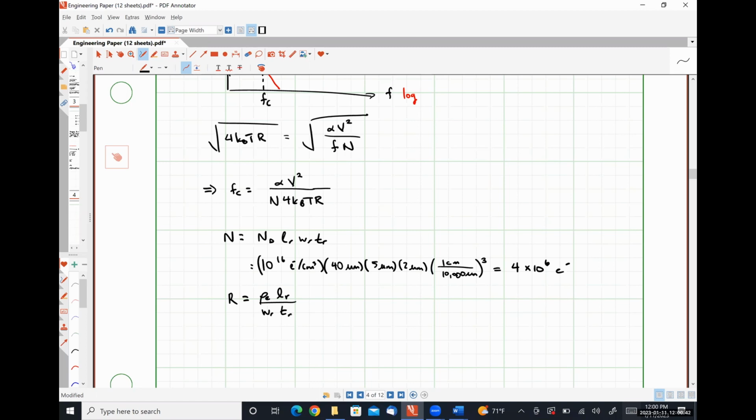How do we get resistivity? One over conductivity. One over conductivity, and our conductivity is q mu_n N_D in this case. Yeah, we're going for it. Absolutely right. So this is going to look like the inverse of q mu_n N_D, because q mu_n N_D is our conductivity.